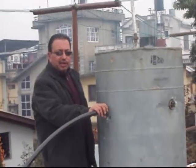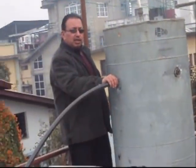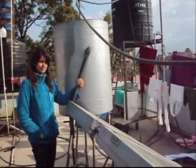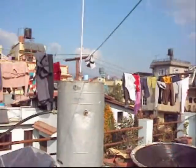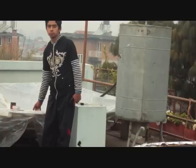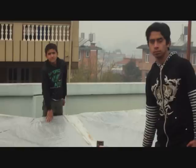I'm pretty sure with this illustration everyone would be enticed to do one on their own — but don't be scared. This is the second day of our installation. Yesterday it was a bit cloudy, but today it was pretty fair sunshine and our solar is working very well. Comparing the results of this solar with the solar which you normally have — this solar was giving a hot water temperature of 36 degrees Celsius and that one was giving 38.8, so there was only a marginal difference of 2 degrees, and the sun was not more than 2 hours. I'm sure this solar will be as efficient as the solar which you normally use.